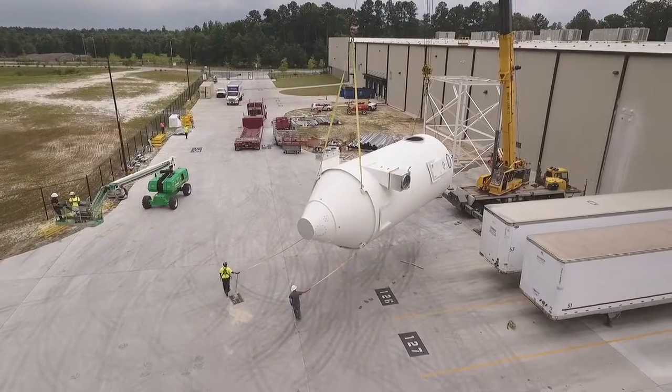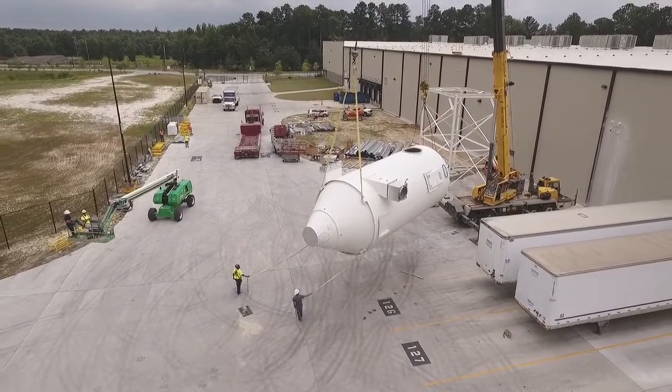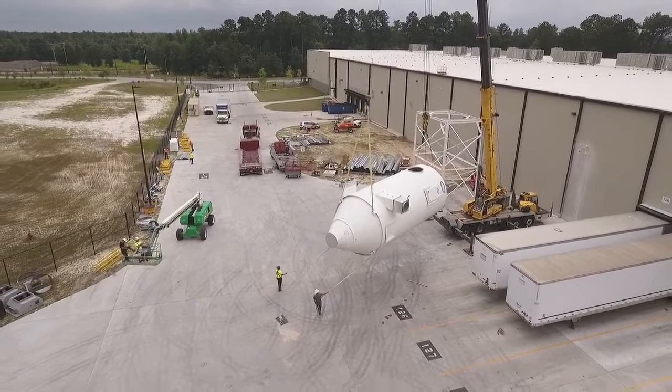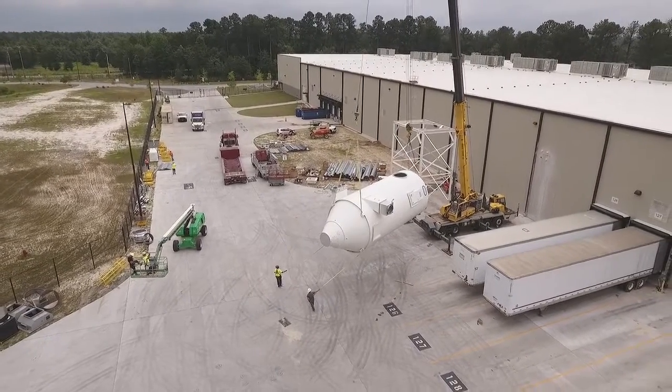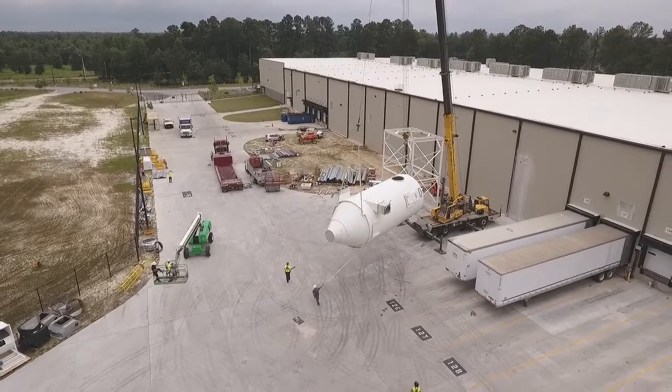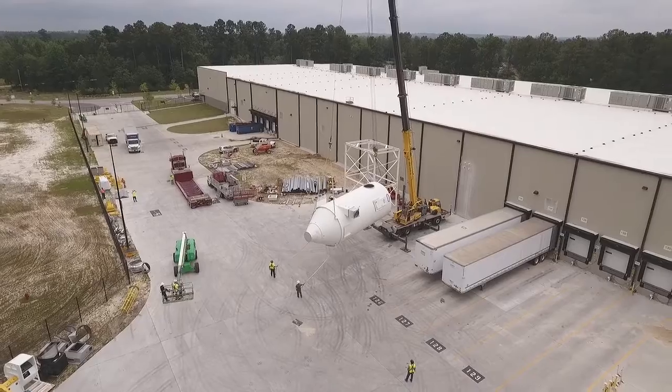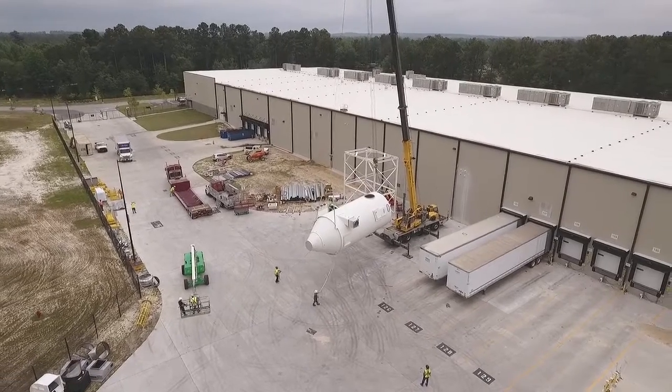GF Puhl employs a dual winch crane to avoid having to tail the unit with another lifter crane. Being able to rotate the 23,000-pound cyclone filter unit in a single move saves time, reduces the cost of the lift equipment, and improves safety for the installation crew.